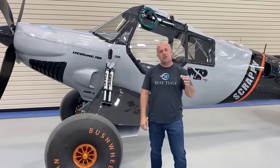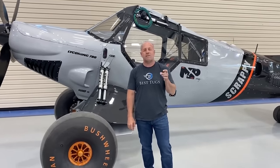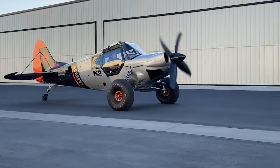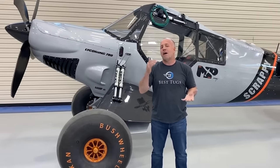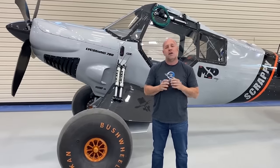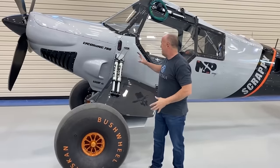Their air systems say they're rated to about 200 PSI of pressure. They actually did better than that. I was able to test them to over 325 pounds of pressure before I got them to fail. However, I need more than 200 pounds on Scrappy to manipulate it the way I want to. I need to be almost double that. In most ride configurations, I'll be at about 400 to 500 pounds. And if I'm riding really soft for really long travel, 375 range. But if I had a really hard suspension, I want that system to be able to handle a spike as high as 1,000 PSI. So I've designed the valving to work with that, and I couldn't use any automotive valve.